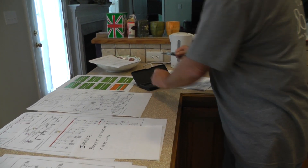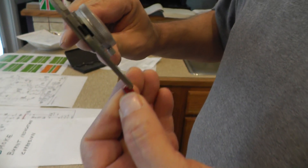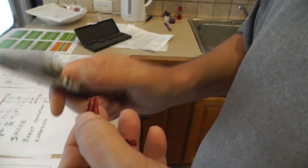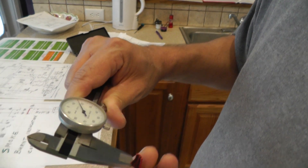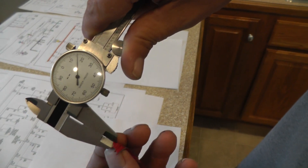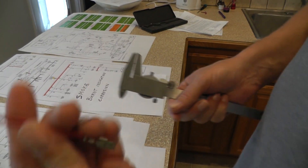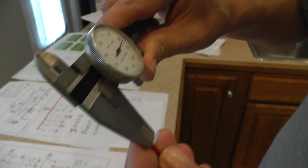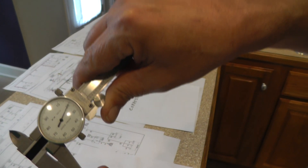While we're in it let's be scientific about it. Let me get my glasses down so I can see. All right, let me make sure I'm getting right on a flat spot here. Okay, looks like about 15 thousandths. Now let's check one of the wires here — a normal wire by itself — let's see what we got on that one. Okay, looks like 20 thousandths. Yeah, 5 thousandths difference — not as much as I thought it was going to be.